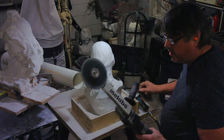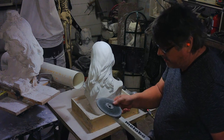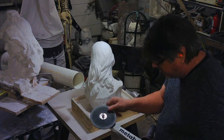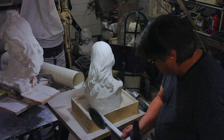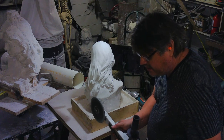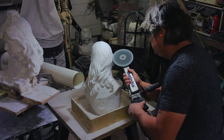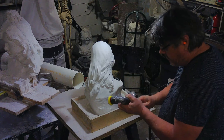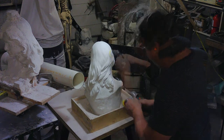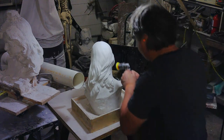And then this is a Metabo fillet grinder and buffer. It smooths the fillets, weld fillets, beautifully. And this is the soft wheel. I have it set on a very, very low setting, and it does just fine. The Harbor Freight 2-inch orbital. I use the white 2-inch pads.